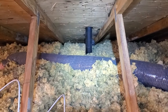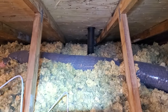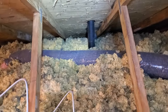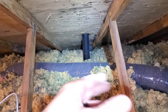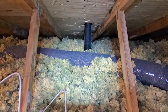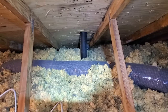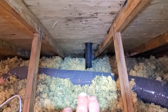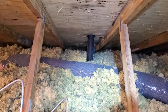I should also mention half baths — I'm not really too concerned with half baths. It's not about odor, though sometimes you might want to address that. The whole idea is moisture. You could still be pulling warm conditioned air from inside and putting it into a cold attic, which you don't want, but you're not going to be running it all that long. This guidance is mainly for shower steam and full bathrooms.